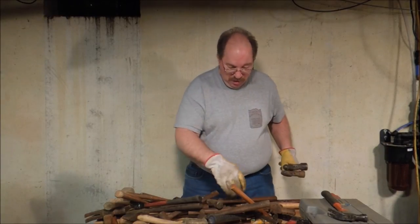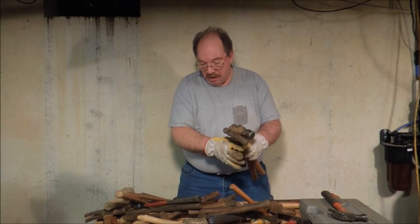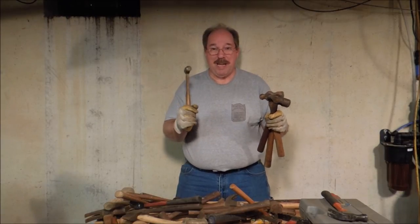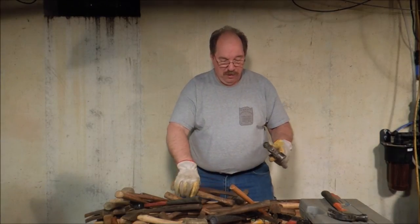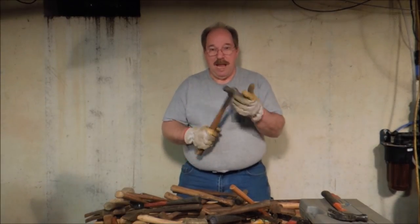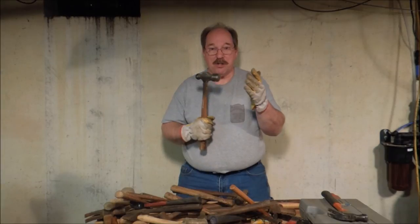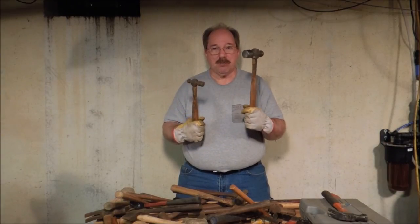The difference is mostly the material thickness — it's got a larger head, a little heavier. Then you've got a one pound and down to a 12 ounce. A little 12 ounce hammer is nice for tapping things into position, but when you're trying to assemble something, tapping with a three pound hammer, you can control the tap a lot more because the inertia allows you to just touch it — you don't have to swing at it. Trying to move something the same distance with the little hammer, you really got to hit it pretty hard. The heavier one, just moving it and letting it stop, does a much better job.